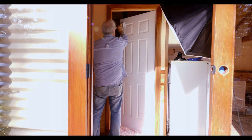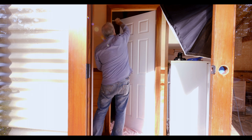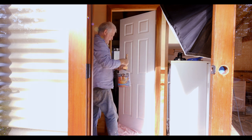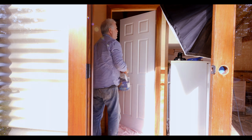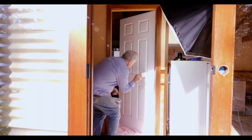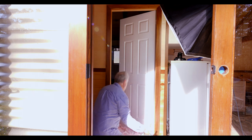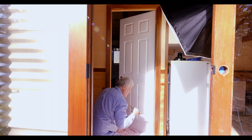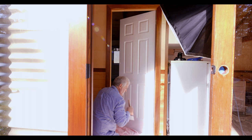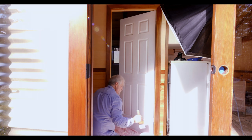You want to paint the door as quickly as you can. In summertime you're going to have less time because of the weather. Right now it's winter so I've got a lot of playtime with my paint — it's going to take quite a while before this even starts to set. Different ball game with oil-based, but with water-based you've got plenty of time. So if you're rolling your edges or getting a little drip here and there, you can just go back and gingerly butter that out. With the top of the door done, now I get on my haunches — it's tougher when you get older. I certainly don't expect you to go near this fast; you're probably going to take three, four, five times longer. Once it starts setting up you're going to get what's known as flashing. Try to push yourself a little bit and go maybe a little faster than what you might be comfortable with.